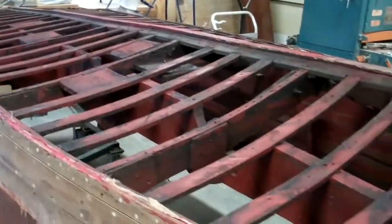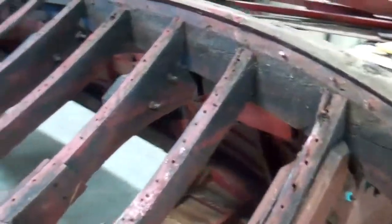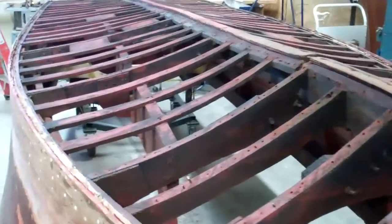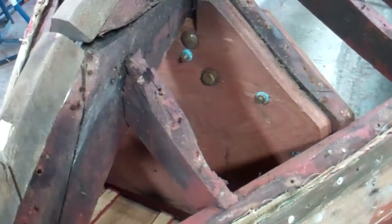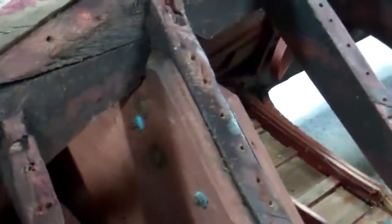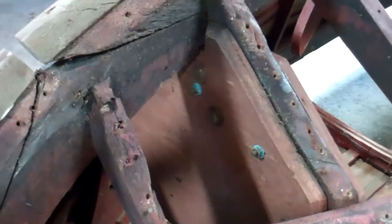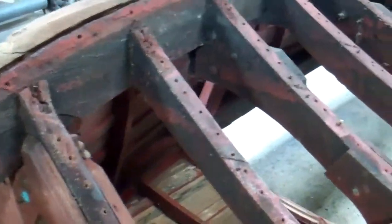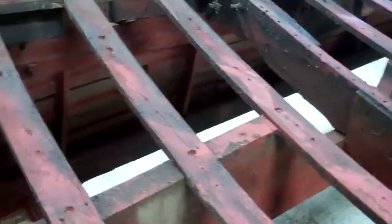The results are really quite pleasing because beneath the planking we found basically a boat that is in pretty good shape. This frame member and this frame member right at the very front, right at the bow, will have to be replaced. We can see that at some point in her life somebody reinforced the bow with this piece of three-quarter inch marine plywood. But the frames, especially in the front half of the boat, and the intermediate thinner battens are all in pretty good shape.